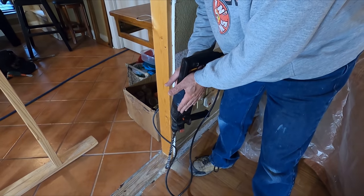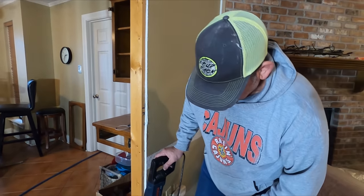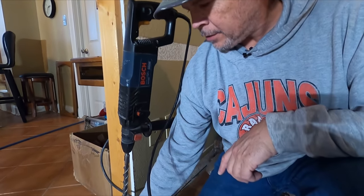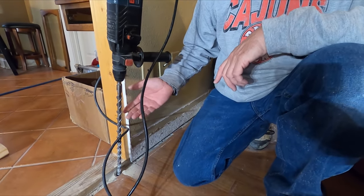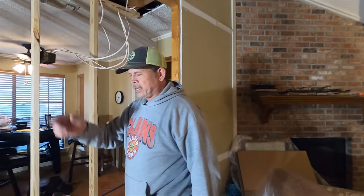So this 3/4 inch hole that deep is about at the limits of this drill. I hit a piece of rebar. I can tell by what the bit is doing, but you get the idea. I could simply move this to a new location to satisfy the engineer. They make bits that cut through rebar, but you see what we're trying to talk about to establish the depth of your footing. So we're gonna leave that there, and let me show you today's project.